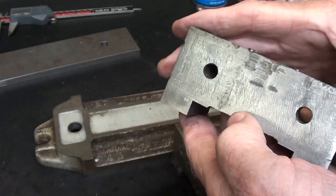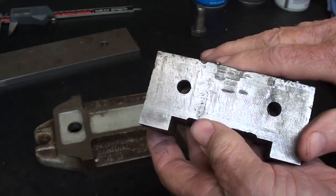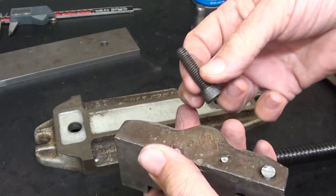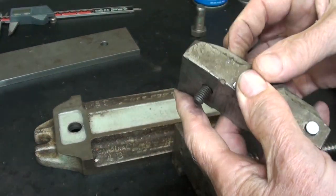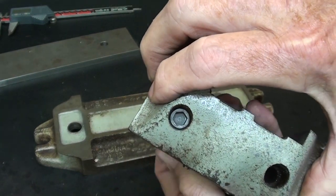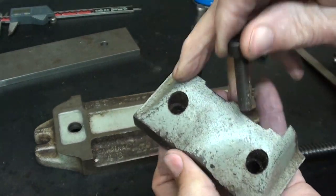What I'm going to start with today is to make the jaw plates, and I've already found cap screws. These are 5/16ths cap screws — I may have to cut some off to length, but you can see that's what these are counter-bored for.